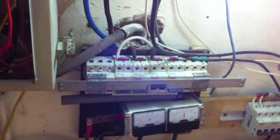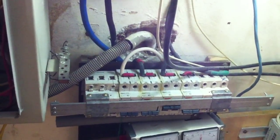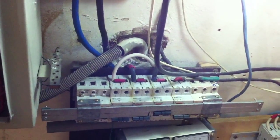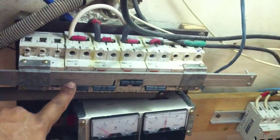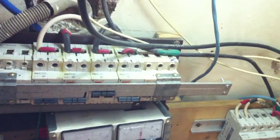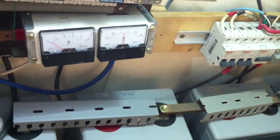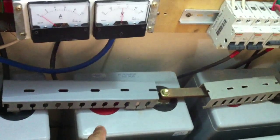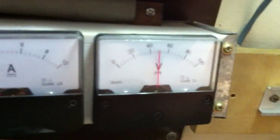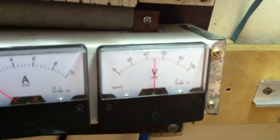These are the changeover switches. One problem I had initially was that when I attached the APC 3000, the charging voltage was too high for it and the UPS broke down. So I added these 3 switches so that I can take a tap from 2 cells down. When the charge goes to 58 volts, I can tap out 54 volts from this, which is quite safe for working with the UPS. Here you can see it's nearly 50 volts going to recharge the APC UPS.